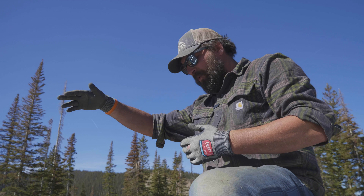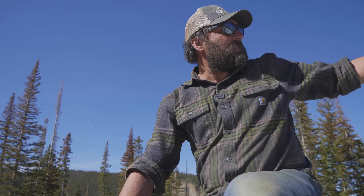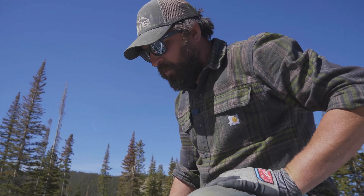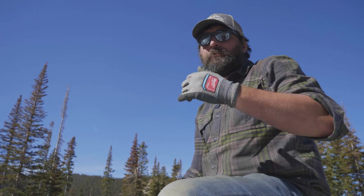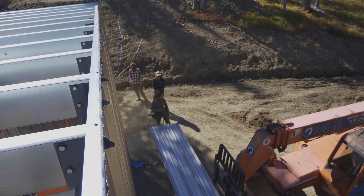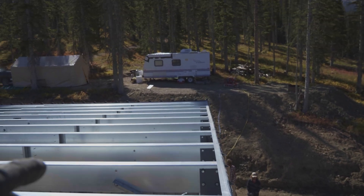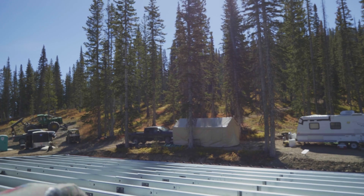This building has lap panels, so we have a 25-foot sheet here — or 24 and 5 inches — and then the top sheet is a little bit shorter, about two feet. It's a little over 40 to 45 feet in total run per slope, and 45 on the other side. We have our sheets pre-drilled — hopefully I didn't mess that up — and we're ready to throw a panel on the back side of the building.